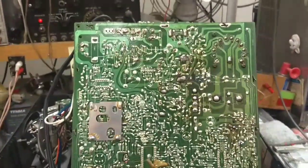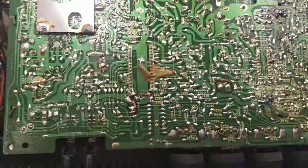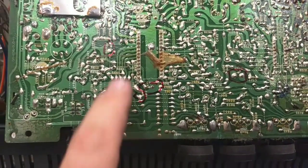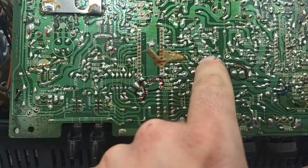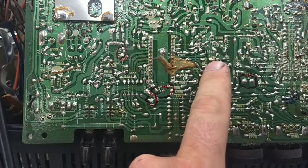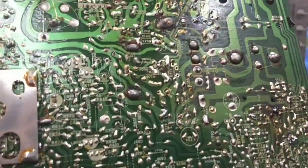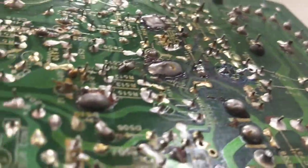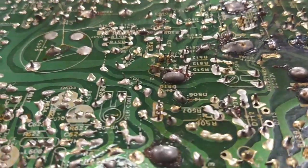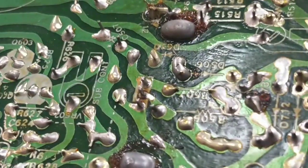Alright, so here's the board up, and I've marked in red here the areas — the capacitors of concern for the circuitry. Here's your IC, your crystal, and the frequency trimmer on the crystal. Those type of variable capacitors are known to go bad, so that may be a problem. We still need to touch up a lot on this board.